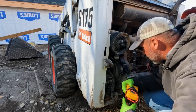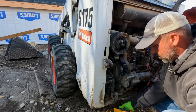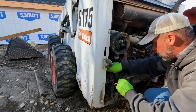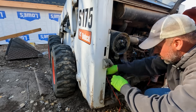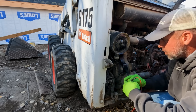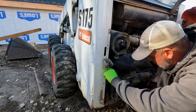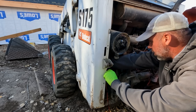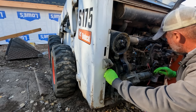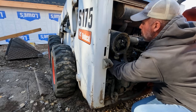There's been a lot of times I'll go on these no-start issues and sometimes it's a battery or battery cable issue. My little brother makes fun of me — he says that most of my service calls are changing air filters and tightening battery cables, and I can't say that he's wrong. We're reading 12.2 on this battery. Let's double check the cables. 12.2 over to the starter as well.